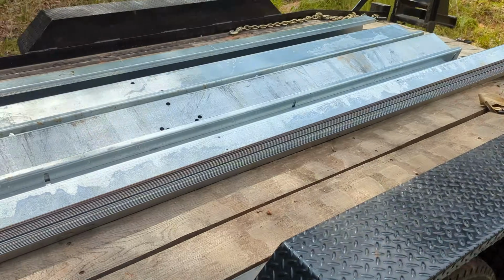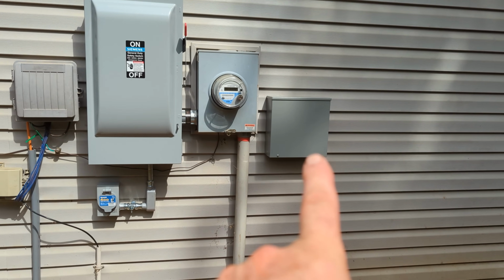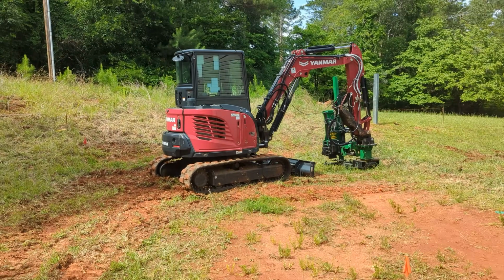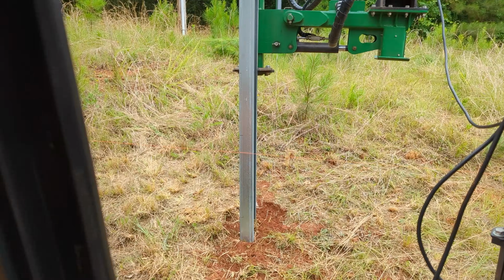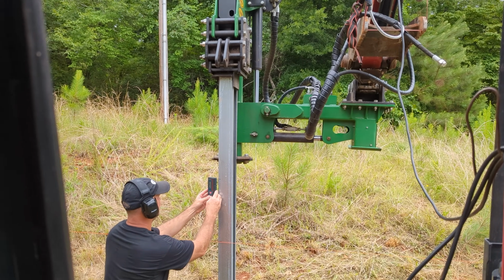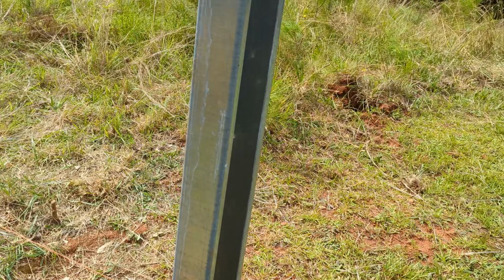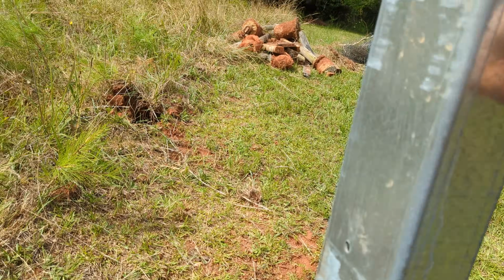And so we got the ground mount, Sinclair of course. And this is all completed, buttoned up, done, ready to land our solar through here. Finding cables. We added some ground rods to the house with some supplemental grounding. It was already grounded, but we added 2 more ground rods. We've got this amphitheater bowl here where we're going to put the solar, and we're going to have 2 16 module arrays. I just pounded a post to see how the soil was so I can sleep tonight, because it was fine. It pounded great. So this is now 72, 73 inches in the ground. It's not going anywhere. It's awesome.